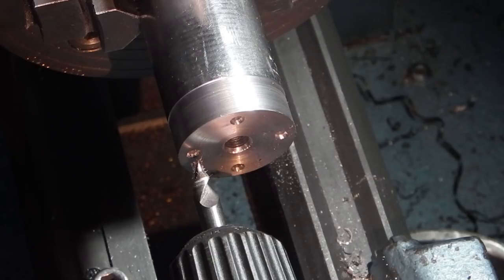I want to control the depth and drill that out to four to five mil. I'm not going to use my spindle post drill — I could do, but what I'm going to use is the pillar drill to do that. I've marked the position so I know they're in the right area. So the next job is to take off all the sharp edges and part that off.